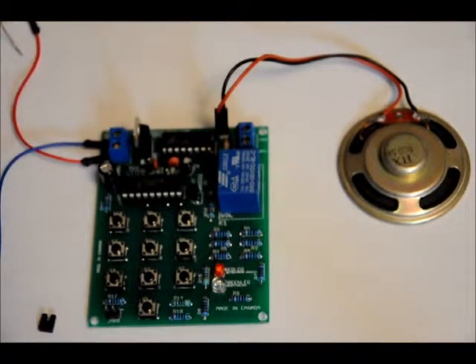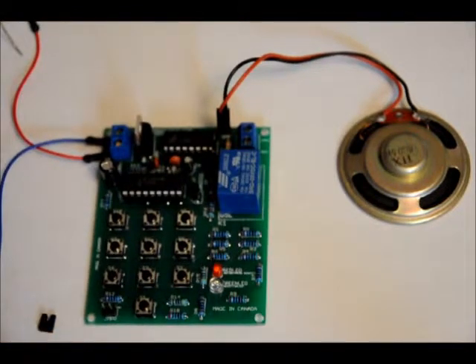I've plugged in my speaker — it plugs directly into the SPK two-pin header. There are two modes of operation. We just powered it on in 'program your own code' mode, also called custom program mode. To use that mode, you leave the two-pin header off the board.